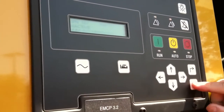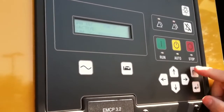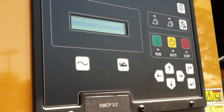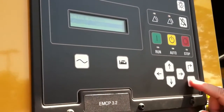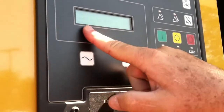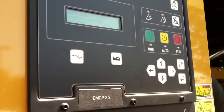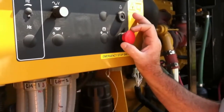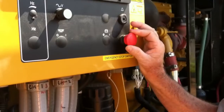I'm going to go ahead and enter, and I'm going to get to gen set control, and it tells me I have one gen set control. I'm going to go back, and it's telling me the emergency stop switch is active present. So in order to clear a fault, I have to clear the condition. This actually backs out and it clears itself.